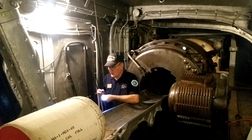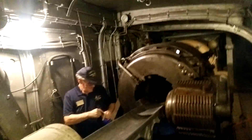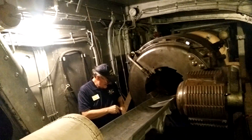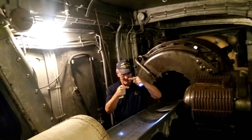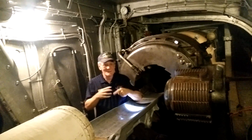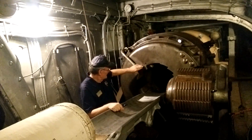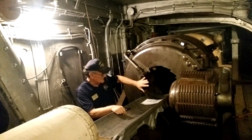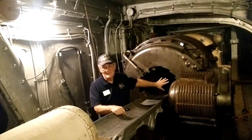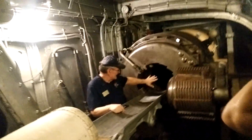The guys working up here would work on this ledge. They had a belt that tied them up against the wall because the unit could only clear them about this much. The guys down here would have to lay down because it would clear their chest by about four or five inches. They said it was terrifying the first few times it went over, but they learned if they didn't stick their head up to see what was going on, it wouldn't hit them. So they would fire that round, open the breech, and blow in 250 pounds of compressed air to purge the toxic fumes out of the gun barrel, and also any embers that were there.